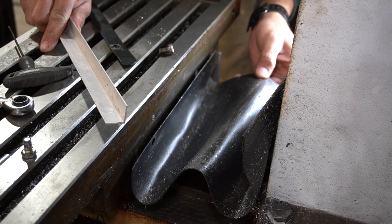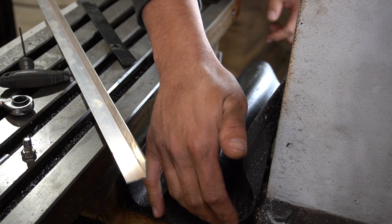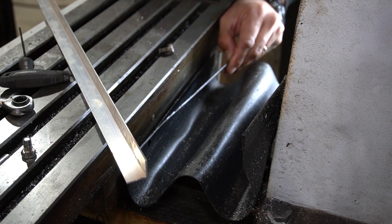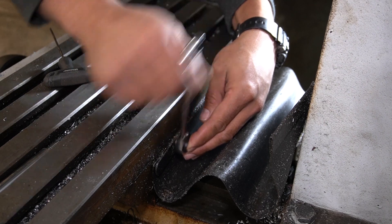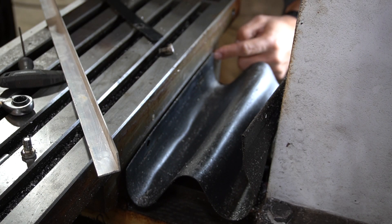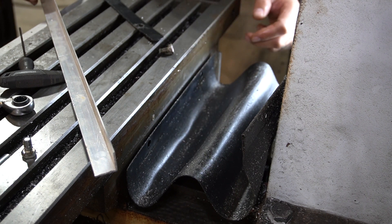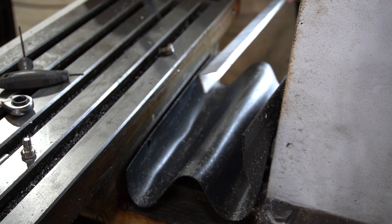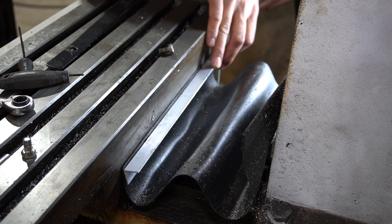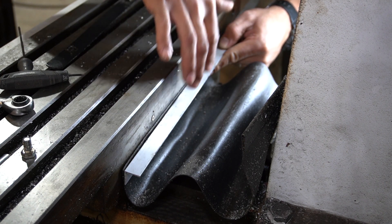So this is the back side of the table, and this rubber or plastic cover keeps metal chips from wearing the cross-slide ways out. It's held on with a piece of flat steel and two bolts. I want to keep this cover, but since it's on the fixed portion, I need to mount the sensor of the linear scale there. My plan is to replace this piece of steel with a piece of aluminum angle, then drill two holes and mount my sensor to it.